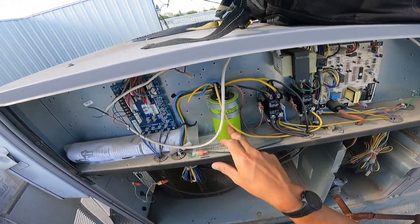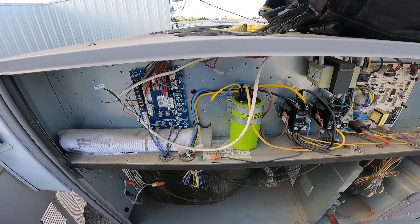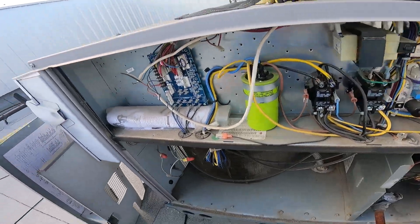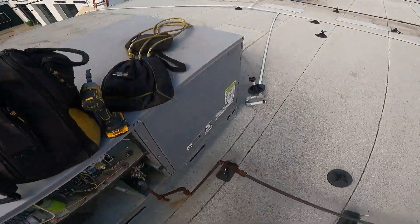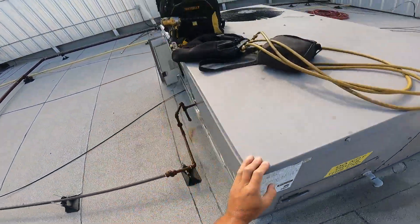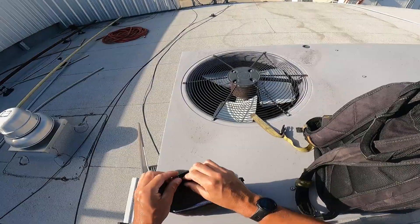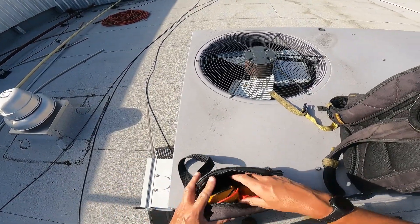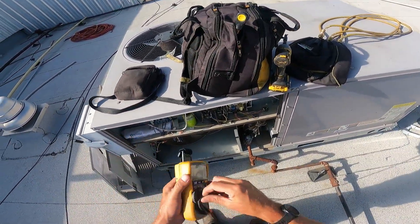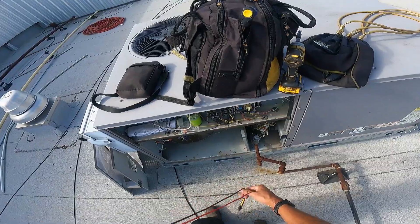That's a capacitor right there. I've never seen one like that. SHP2 - 70 by 5 microfarad - that means this is a single phase unit. Is that accurate? Because the compressor should not have a start cap if it's three phase. This is a single phase unit. Hopefully this will be a quick one - we find a bad motor, move on with our lives. Or even quicker: we find a burned up wire, fix the wire, motor turns on, everybody's happy. That would be much more gooder.